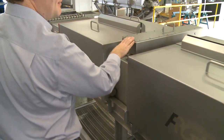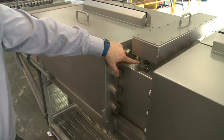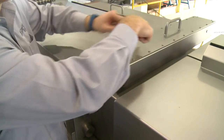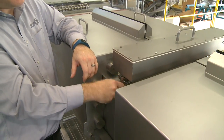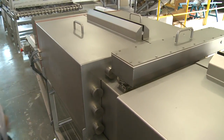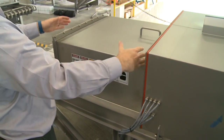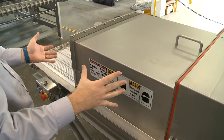This is the other side of that same PHI module. These are actually sanitary fittings — you can quickly disconnect these if you ever need to replace the cell in there. These are the cells actually bolted on. You could clean it in place, but if you wanted to, you could take off these sanitary fittings and bring it back to your workbench. For the same upper hoods, this is just an inlet shield — there's no lamp in this section, just a light-blocking area.